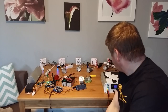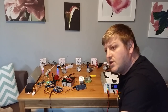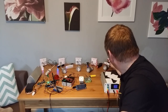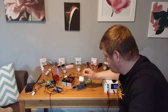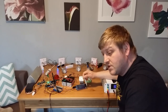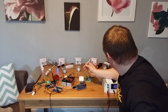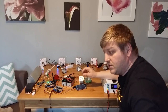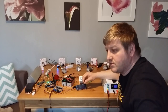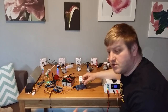And also I'm thinking, for the software that runs in the one for the bathroom, to add another sensor there, for the humidity. And to set up also in the main panel here, in the same way as the thermo, a controller for the humidity to control the fan in the bathroom. Let's see, when the humidity goes up, like when you take a shower and a lot of steam is there, to turn on the fan to extract that steam outside.